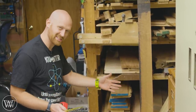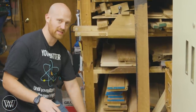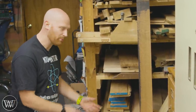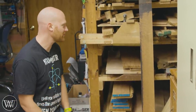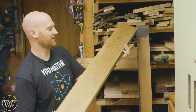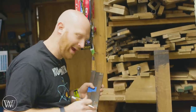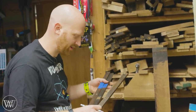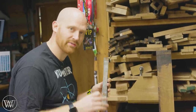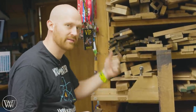The question is the top, which needs to be 18 inches wide. I don't have any 18-inch-wide boards — I have a couple that are 12 and a half inches, so I'm going to have to sandwich them together. I want it to be a full three-quarter inch thick, so I can't butterfly them. I'll pull some scrap and see what I can get for the top. For the legs I need inch-and-a-half thick stock, and I've got quite a bit of that. For the hashes I need material that's three-eighths of an inch. Some of what I have is a little over three-eighths, so I'll trim that up, but for the rest I'm going to rip three-quarter stock down into three-eighths inch strips.